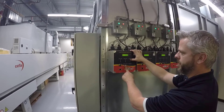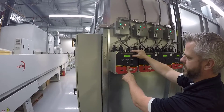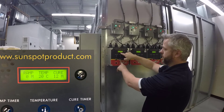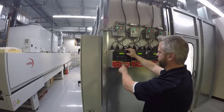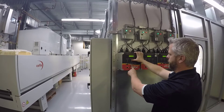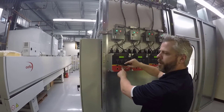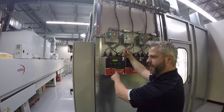With no probe, I can set it to a percentage of power. Holding the standby adjust button, I can see cure time, gas percentage, and a ramp. If I go back to probe mode, I have a cure time and a surface temperature for my product, plus my ramp. At 30% gas is very common — this is something we typically work out with your coating supplier by monitoring the surface temperature of the product based on cure time until we find that magic number.